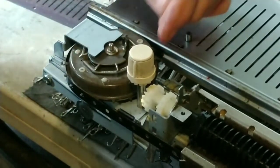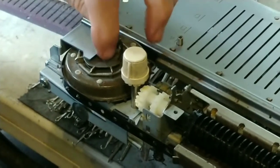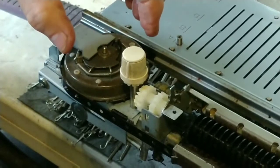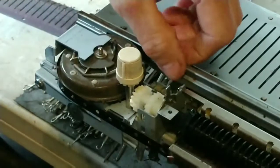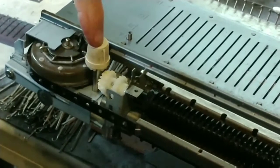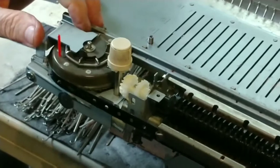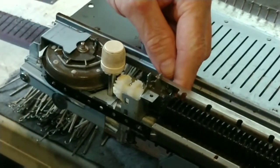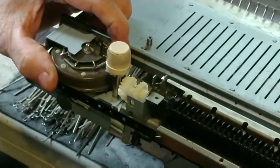If they're not aligned correctly as we described in the first of this video, that's what you have to do. You have to free the cam — the drive cog — from the shaft by lifting it up, so it'll rotate while your cam rod stays in position. The relationship is as the belt moves this — watch, this is your clear cam — when that goes up and down, that's a cam on the bottom of this drive cog that makes that happen. But it's got a gear under it, and that's what's turning your cam rod at the same time. So any attempt to adjust without disconnecting the linkage fails.